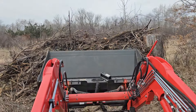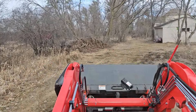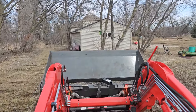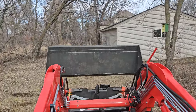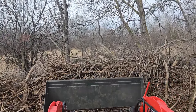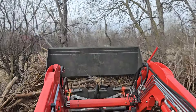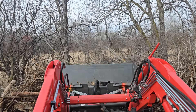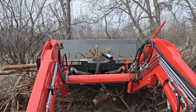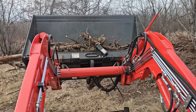It really does work good. I don't own a traditional bucket or a grapple — this is the only multi-tool like that that I actually own. The other things are just a set of forks and a stump bucket. You can see everything is snappy. This bucket is really meant for skid steer — it's got that big long face on it, normally it's a little more narrow when you have a tractor. But it depends on the dynamics of your loader, how much extra lift capacity you have, how well you can see. In some cases it's nice to have that extra long bottom — because on a tractor your visibility to your bucket is somewhat limited, so having more area to work with can be more helpful.